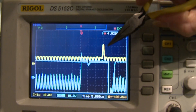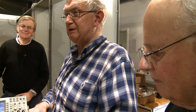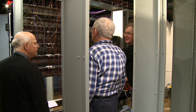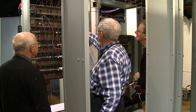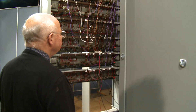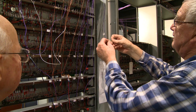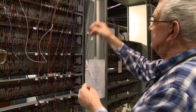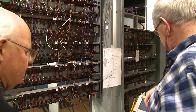Because it's basically the signals bouncing from there, what we're going to try and do is use standard components and attenuate the signals to prove the point that there's some incompatibility. The plan is to put some extra resistance in to reduce the size of the signal. It's all switched on now, so being very brave, the wire carrying the new clock signal is taken off and connected to two resistors onto ground to reduce the height of the signal by 50%, which should reduce the amount of noise flying around.